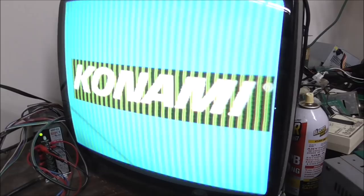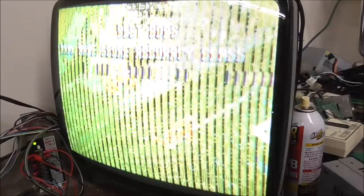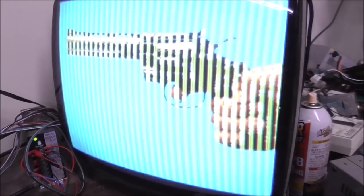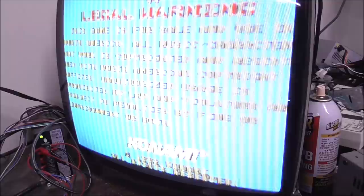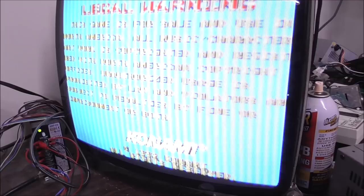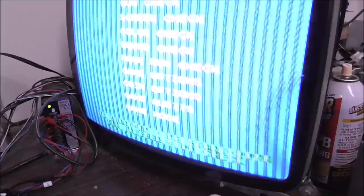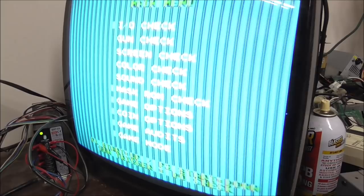So I swapped the chip. That gave me that address line back and changed a lot of what's going on on the screen — the colors have changed. Remember how we were in that color test where I was saying the bars didn't look right? That was red before, like it's supposed to be, but it actually looks a little bit better. It's just the wrong color now. And that part looks a lot better too — so it looks a little crazier, but I think it's actually a little better because a lot of the stuff is a little clearer now. Color is back — remember, that wasn't there before.